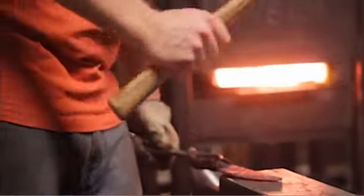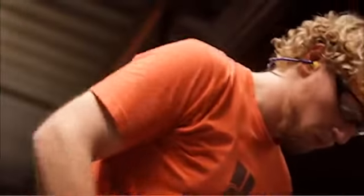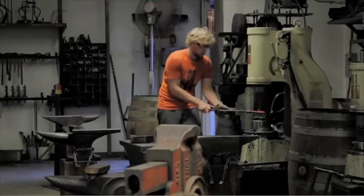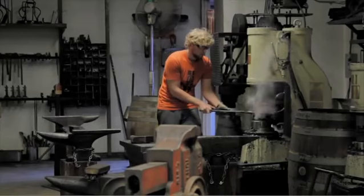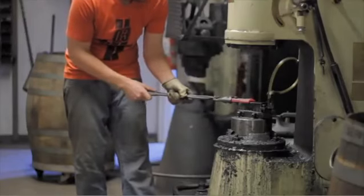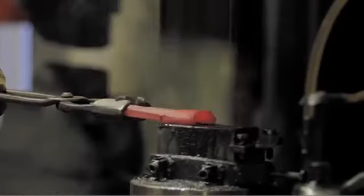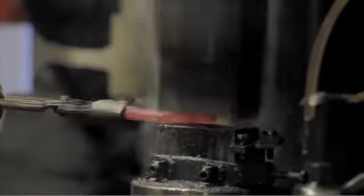The more you cook it, the more likely the steel is to shatter. Once the blacksmith has done as much as he possibly can to the softened steel, a machine is brought in to finish the tapering process. This is the power hammer. It is used for precise and heavy work. It slams down an 88-pound hammer upon the metal, which is significantly larger than the handheld one. Not only does it have immense strength, but also extreme precision.